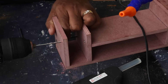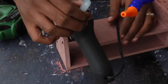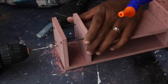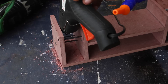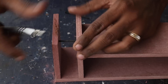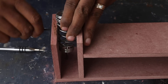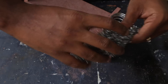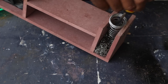The hot glue gun and soldering iron fit at the ends of the soldering station and are held in place using screws. For the hot glue gun, I drove in some screws so that no matter how I set it down it never touches the MDF base. For the soldering iron, I used a conical spring from an old soldering station, clamped tight between the sides using screws. At the base I placed some metal scrubber — this prevents the hot tip from touching the base and also helps clean the tip.